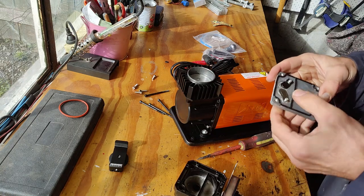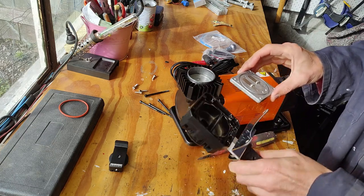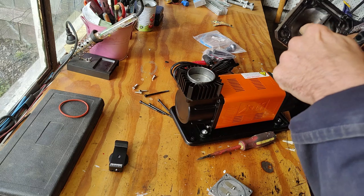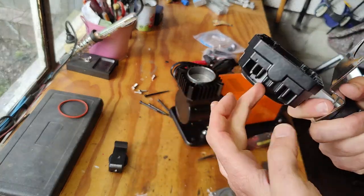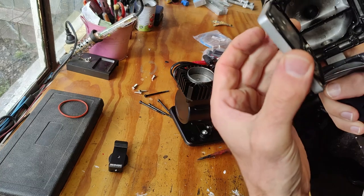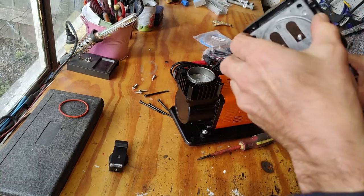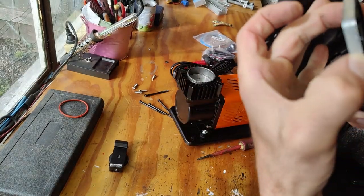We have the valves one way. So the air must enter through here. Air must come through the hole through the top, through these two holes, enter into the piston, and then through these other holes, air comes out into the chamber.